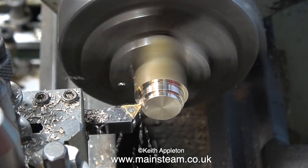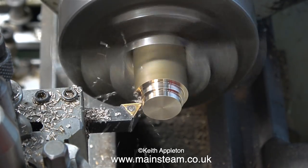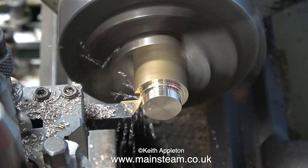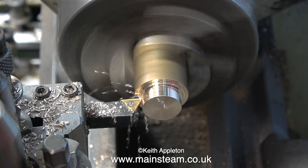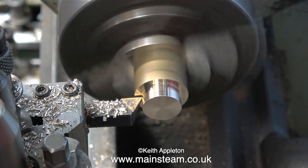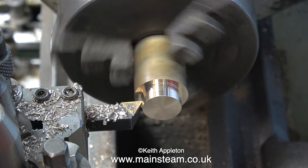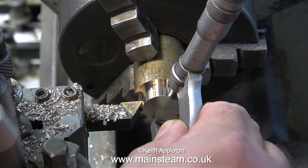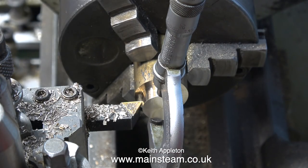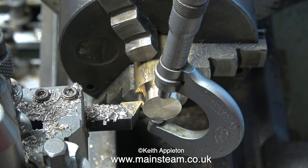The next cut is not quite as heavy, and you will notice that the sound has changed from the chattering one to the normal sound of a lathe tool cutting a piece of brass. I have to reduce this centre part of the brass down to quite a small part. The outer diameter needs to be around 7/8 of an inch, but the centre piece needs to be very small. And the 7/8 of an inch is there — as you can see, the micrometer clamps in place.